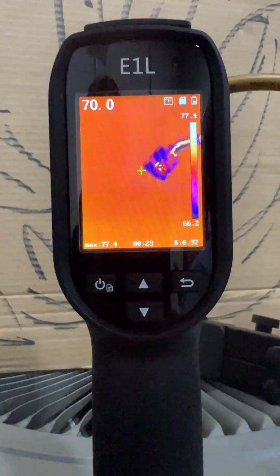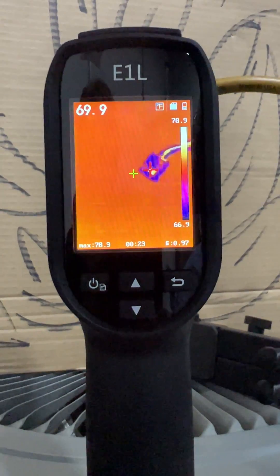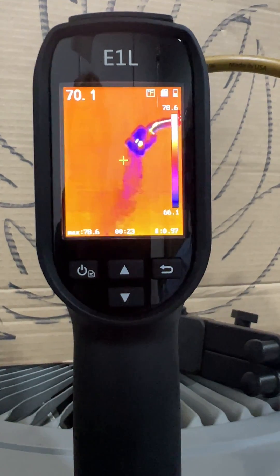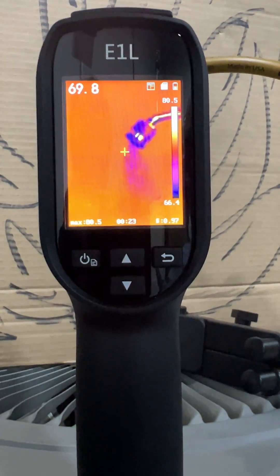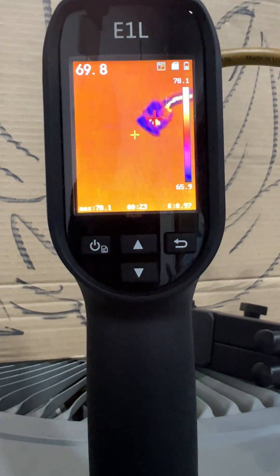You could probably pick up with a leak detector, but if this was again filling with air, what we would see is a trace amount of refrigerant — which I'll crack here again. You can see that, and as long as the refrigerant's falling out of the hose, you can see the vapor. So this is a very, very small amount of vapor, but as soon as I shut it off, it's like I put my finger over the end, and no air can come in, and no refrigerant can come out.